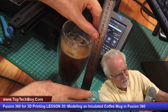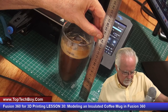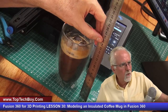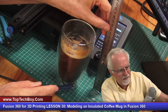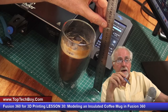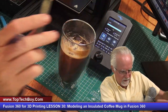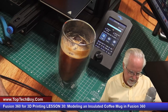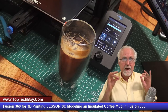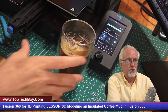Now let's look at how tall it is — a nice round 150 millimeters tall; height is just height. And the question is where is the tangent point? It's getting wider, wider, then narrower — where does it go from getting wider to getting narrower? That looks like it is right at about 100 millimeters. I'm not going to try to measure the amount of bulge — we'll just eyeball that — but I've got some pretty good numbers to get us going.